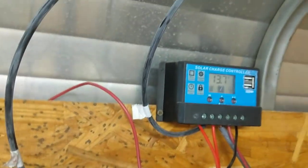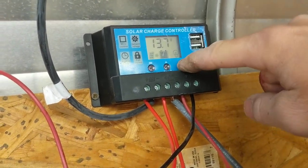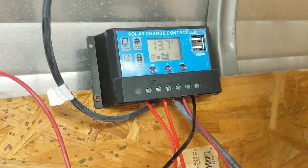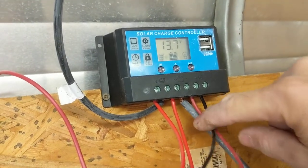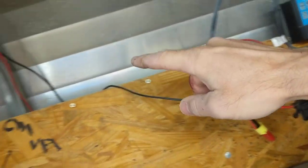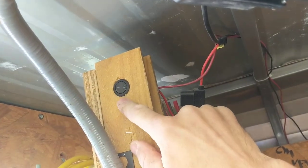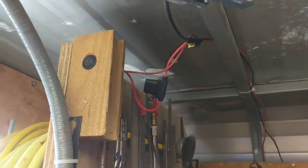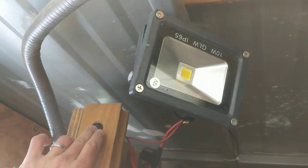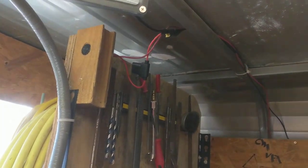So what I have hooked up to it is a light. That is a light indicator right there. You can turn it on or off via this little button — you can see I've got it on, so now power is traveling through this circuit. We've got negative and positive coming down, flowing through, going up behind here, coming on over and going to a little toggle switch. This is just one you'd find for a dashboard. That's my little switch right there to turn on this light, which is a 12 volt LED light.